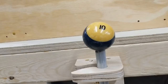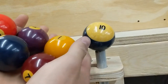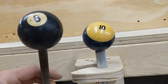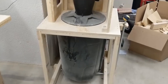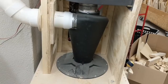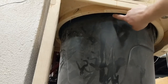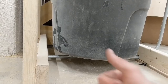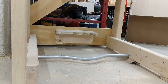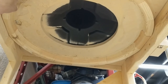I found some of the chips I made when I drilled the hole in this thing. This ball is not the same from that last set of balls — I have a few mismatched pool balls that I've bought at garage sales over the years. I save them when I use them for machine handles like this — this is the gear shift off my lathe. That lever is part of the dust collector. The blower is from a Harbor Freight dust collector — the rest of the dust collector is in the trash. I've got a cyclone separator hooked onto the inlet of the blower, and beneath the separator I have a 32-gallon garbage can. The lip of the can is sealed within this wooden ring. That lever with the pool ball we saw earlier is what presses the garbage can up into that ring. When I move that lever up, that bend in the pipe goes up and pushes the can into the ring, and that lever locks into place in this detent. The ring was machined with a tapered edge in here, so it fits tightly against the lip of the can.